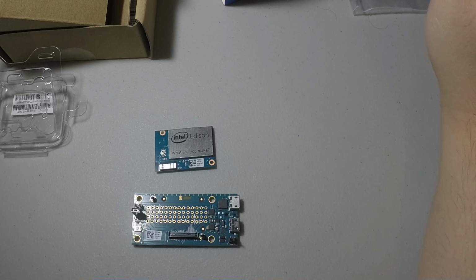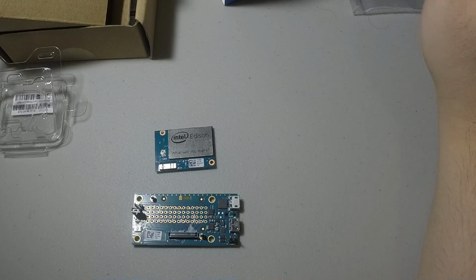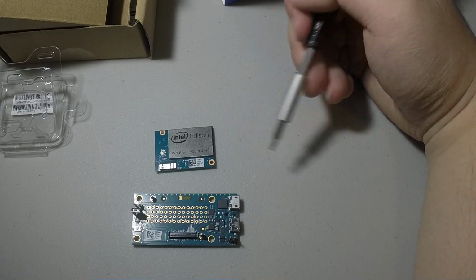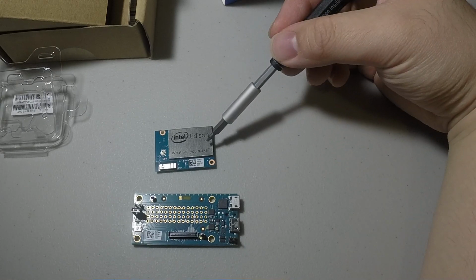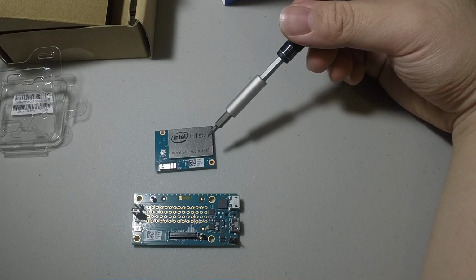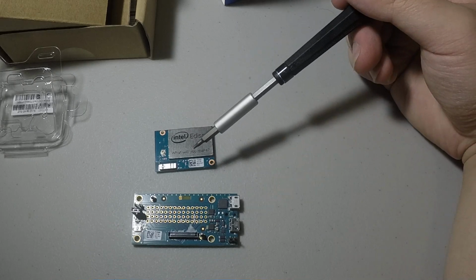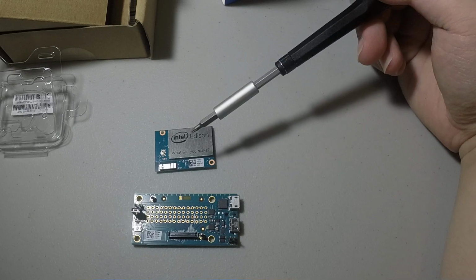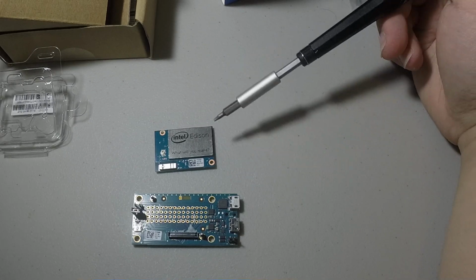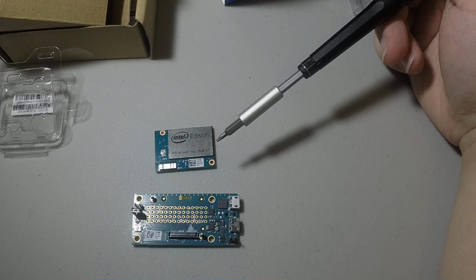It has a dual-band 802.11 ABG Wi-Fi built in. It has low-power Bluetooth 4.0, which on its own makes this board worth it in my opinion. Just because the board alone I believe is $50. So you're basically getting an extremely fast processor, plus, well, it's two things. It's a processor and it's a microcontroller. So that alone is amazing. Plus the fact that it has built-in Wi-Fi and Bluetooth. It has an insane amount of built-in RAM, and built-in flash.